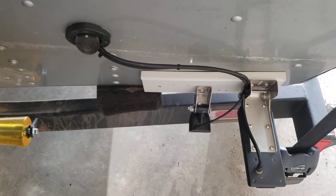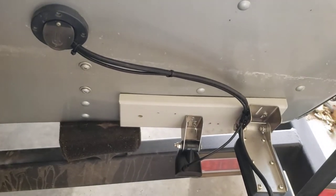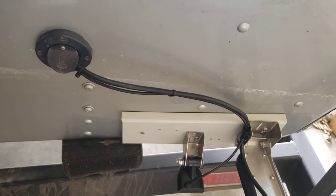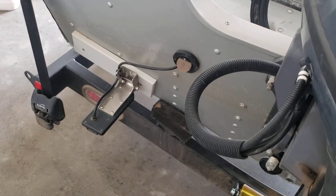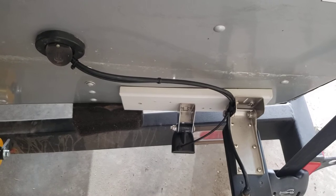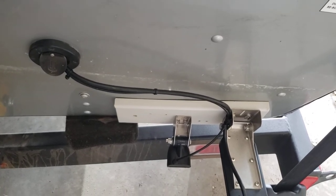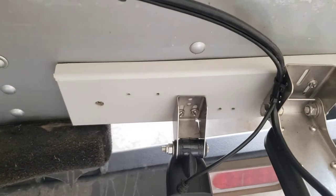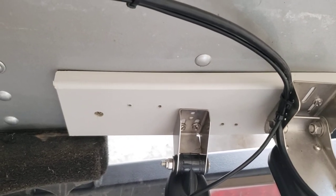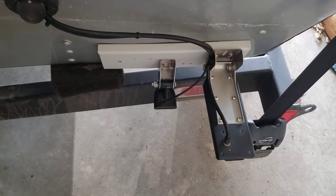Another thing about transducer installs is that board the transducers are actually mounted to — that's just a piece of plastic, a composite board. I used them on both sides; I picked them up at the local farm store. They're just a piece of plastic and I screwed that into the hull. That way, I can move transducers around, replace them, whatever, without having to drill more holes into the hull. You can see there's some extra holes where things have been moved around or replaced, and I didn't have to drill any more holes in the boat. It works out very well — it's something I would definitely recommend, and something a lot of dealerships don't do.